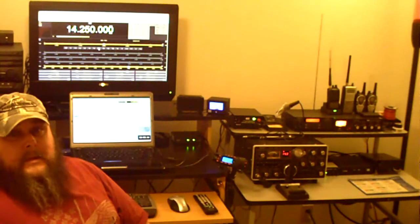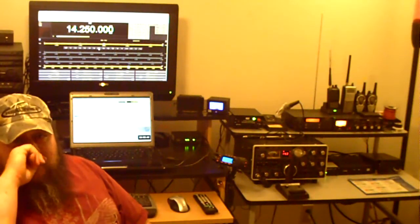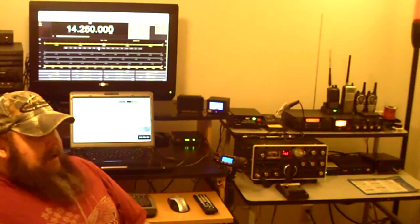I'm getting a lot of RF back in the house because of the aluminum siding — the VHF/UHF antenna being physically inside is bouncing RF around, so I need to get it outside and above the roofline. I've been making contacts on 40, 20, 15, and 10 meters. The dipole works for anything above 40 meters but won't tune on 75 or 160 — it's just not long enough. I've also got an Eagle One vertical I need to put up on a tripod mount on the roof, and I'm going to build a loading coil so it will tune on 80 and 160.